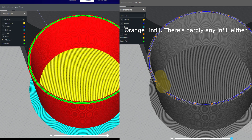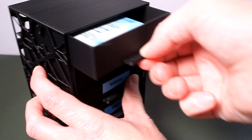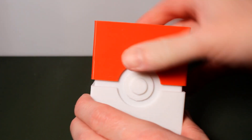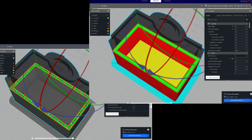This is definitely a technique you'd want to keep in mind every time you're printing something that's essentially a container — so that might be a cup shape like this, or it might be drawers like resistor drawers or a storage box, or it could be any kind of case like this one for trading cards. If you eliminate the infill in the sides by increasing the walls, then you will save time, you will get a stronger wall, and perhaps even wear and tear on the printer will decrease too because there aren't so many small movements and shaking.